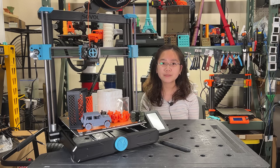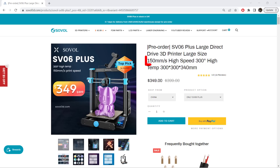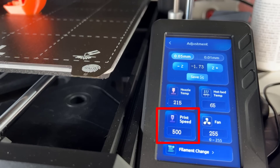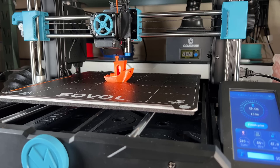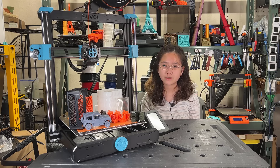Other than that, I don't have any complaints about this machine. However, I do have another suggestion for Sovol regarding their claim about the machine's 150mm per second print speed. After increasing the acceleration to 1,500mm per second squared and increasing the print speed to 500%, I was able to print a one-hour Benchy at around 100 to 120mm per second with reasonable results. To further boost the speed to 150mm per second and above, Sovol can make the Klipper firmware and printer.cfg config file available for downloading. This would enable the use of a Sonic Pad, Speeder Pad, or a BigTreeTech CB1 board to run Klipper. Given this printer's great motion system, strong extruder, high-flow hotend, and good cooling, printing quickly with Klipper should be a breeze.